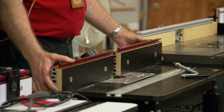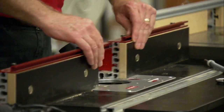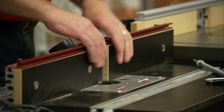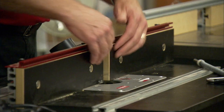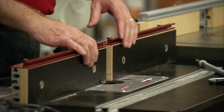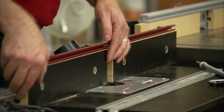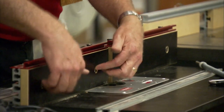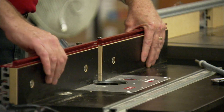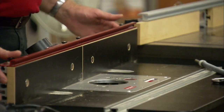All the fences work well — you move them forward and back, lock them, and you want independent faces so you can open up around the bit. You want to keep those faces closed up as much as possible against the bit for best dust collection and to prevent your board from dropping into the opening. These fence faces are not really meant to be sacrificial — if you want a zero-clearance effect over your bit, your best bet is to attach some kind of sub-fence over the top. Just take a piece of MDF or plywood, glue it on there, ease it into the spinning bit, and that gives you zero clearance. It's not very often that you really need zero clearance on a router bit, but you can do it.